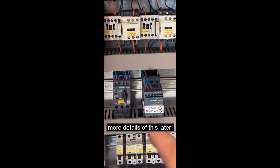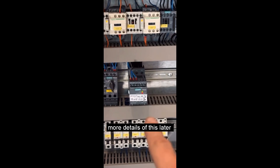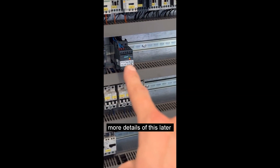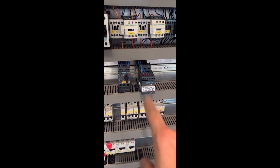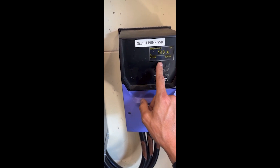It goes from that contactor to that soft starter. That soft starter ramps the motor up from zero to full speed and then it runs at full speed. I don't need that because this drive can run it at any speed it wants. What's happened is that's part of the original fit and they've added that to it. So when this was slowly ramping up its voltage — doing its voodoo magic — this was monitoring its input, saying the voltage is wrong, and tripping out.